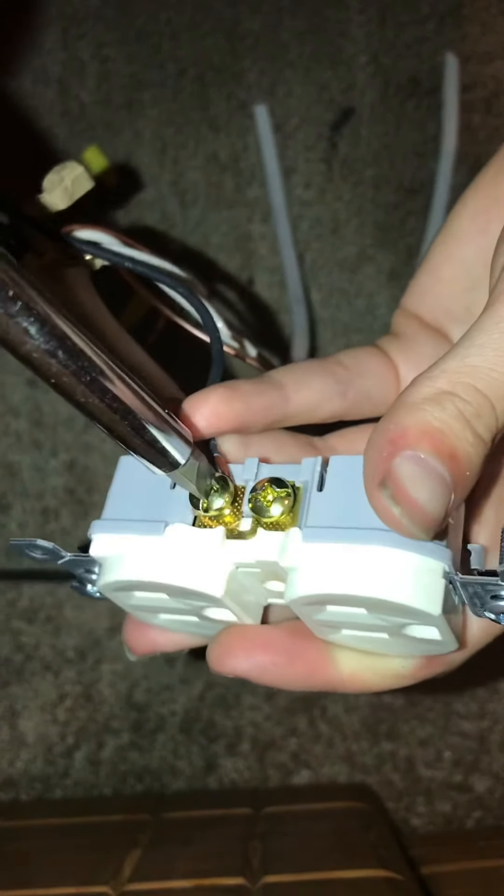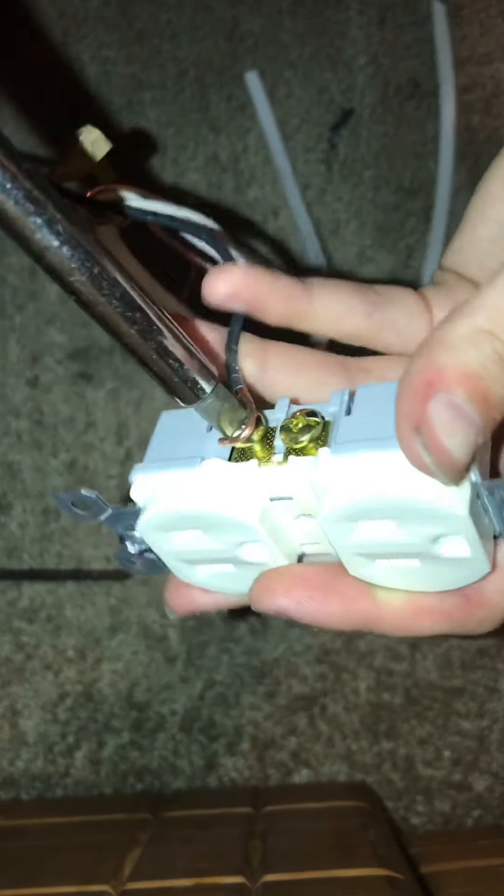Moving on to the plug — my wires are already stripped. I'm taking the two hot wires and tying them together, making sure their stripped ends are close together so it's easier to wire-nut them. Then this is where you'll have your first pigtail: take another black wire from a separate set, line them up, and tie that one in as well. That's roughly what it should look like — maybe a little tighter — with all wires around the same length. Then wire-nut those three hot wires together, twisting until they're very tight. Then I made a loop with the pliers and screwed it onto the gold screw.